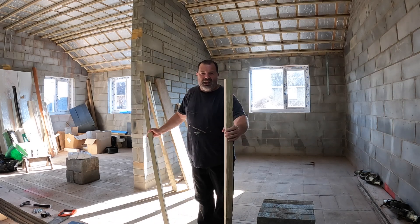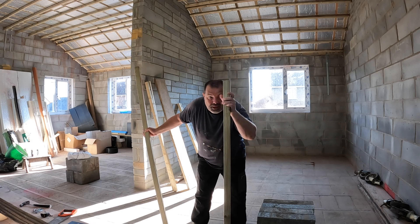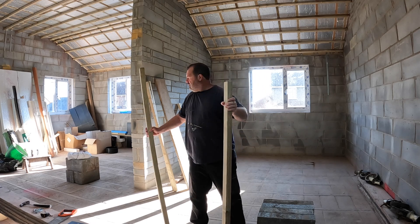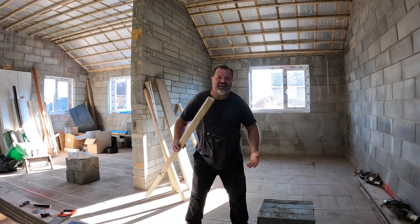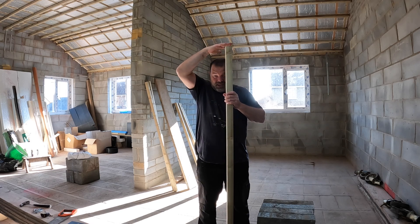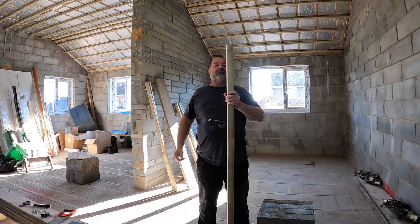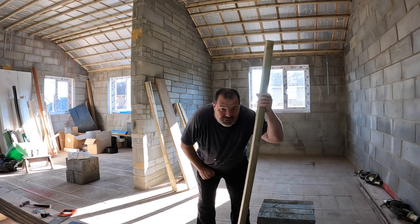Anything shorter isn't so comfortable to use, because what you're going to do is bend down and sight down with your eye across the top of the wood. If you've got the bottom of this in a trench, the top can be down low so you're trying to bend down uncomfortably. Something at eye height I find really good because I'm sighting through at eye level, which is comfortable — I'm stood straight. And if I drop this in an excavation you just bend down to that height, subject to the depth of your excavation. If your excavation was a metre deep I'd obviously make these a lot longer.